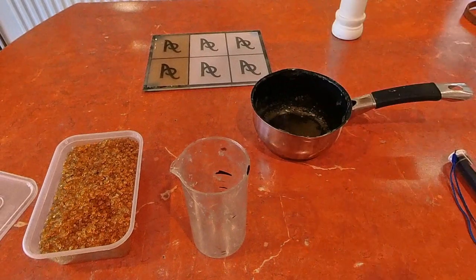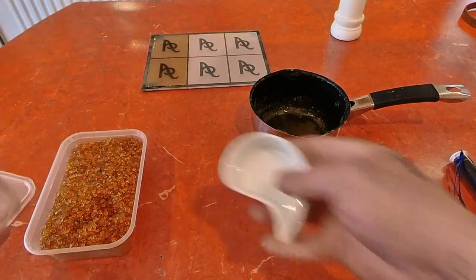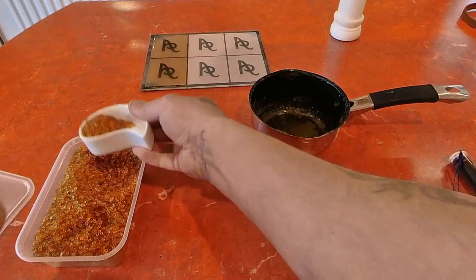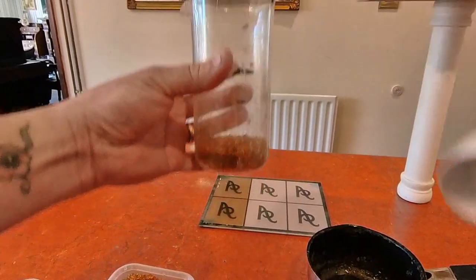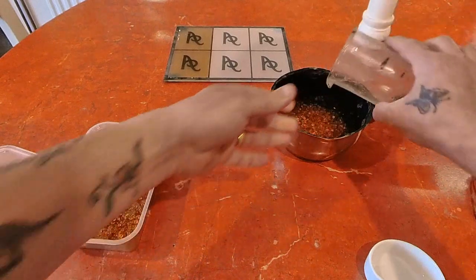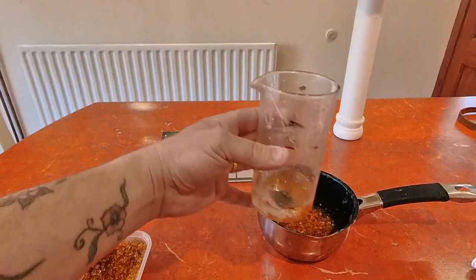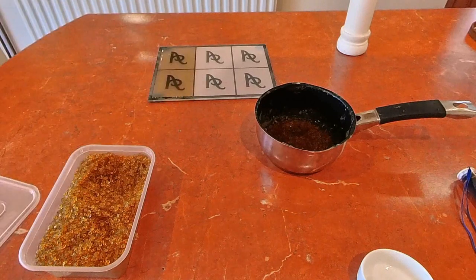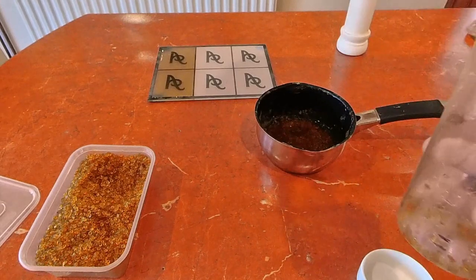While I'm waiting for the glue to set on that piece I'm going to mix up the next batch. The last mix was one part glue to 1.5 parts water by volume, not weight. This time I'm going to do half and half — one part glue to one part water. I'll leave that to set, heat it, and apply it to the middle two panels. Then I'll mix a ratio of one part glue to two parts water and apply that to the other side panels.